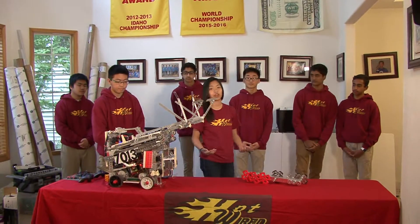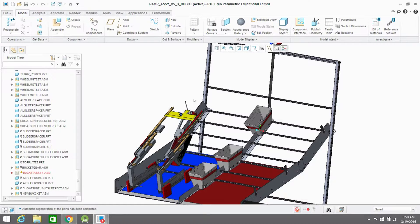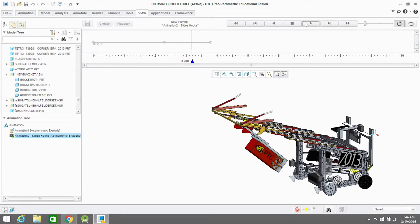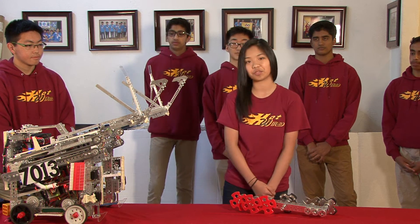This year's challenge was very complex, so we needed 3D rather than just 2D analysis. We used PTC through every stage of our design, specifically to analyze different frame angles and make sure our bucket could reach the high goal without our robot tipping over. The different iterations shown earlier were all designed, printed, and positioned using PTC. We also used MathCAD to do stress calculations for our linear slides as well as other calculations for our robot.